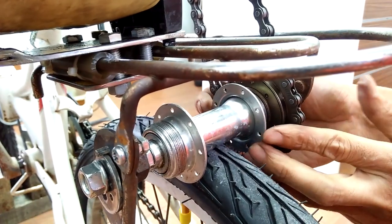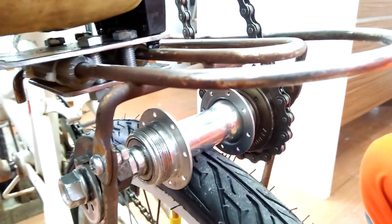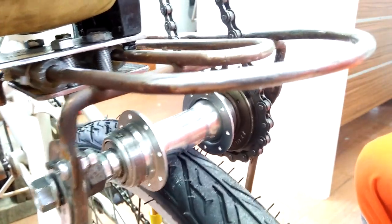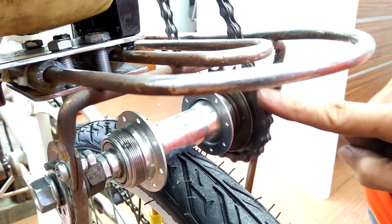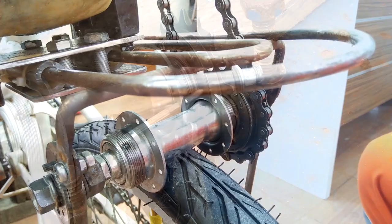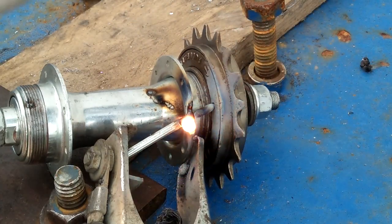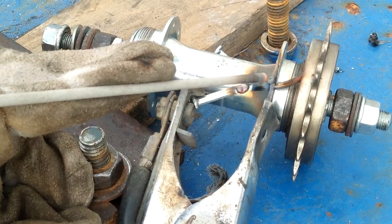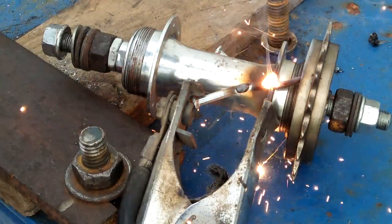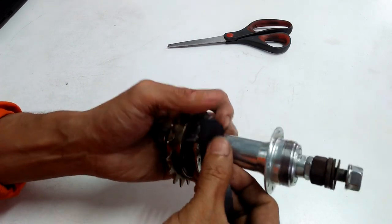You can see that the rear wheel rotates with the spindle. However, the spindle should be rotating in the opposite direction from the rear tire, which causes the freewheel sprocket to disengage on the threads. I simply welded two nails poking at the two dimples on the sprocket, and that effectively prevents it from disengaging. I also wrapped the spindle with rubber strips to provide better grip.